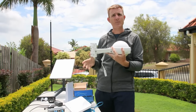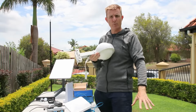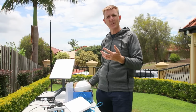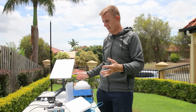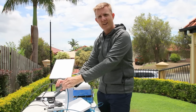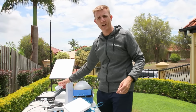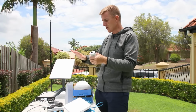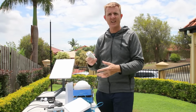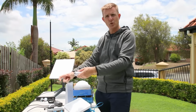We are going to need to get a cable out to it, like I said. We're going to use a pre-made cable. And then really looking back at how we're going to do this, we can do this in 2 ways. All right, so remember, if we started back at a bit of the video, we just had our one Ethernet adapter and we went into a PoE injector. So if you're just looking to extend this and not do anything inside your property, then you could just connect directly your PoE injector with your short cable.